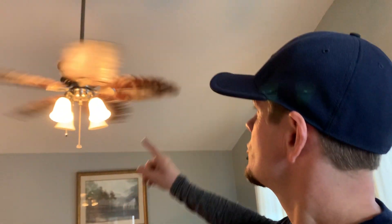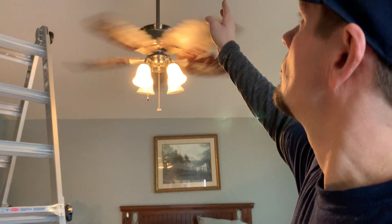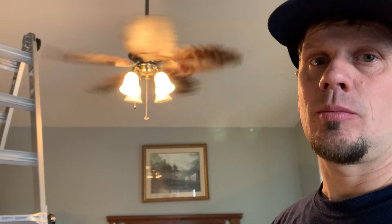You have to have a black, white, and a red or a blue. The blue wire up there went to the red and the black to the black. If you only have two wires up there and you don't have the red up the wall, it won't work either — unless you're just going to have the fan and light come on together.